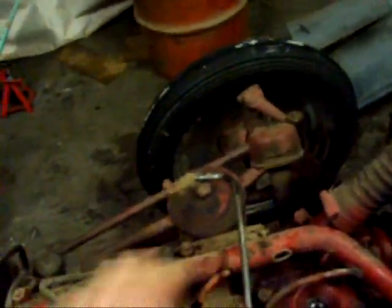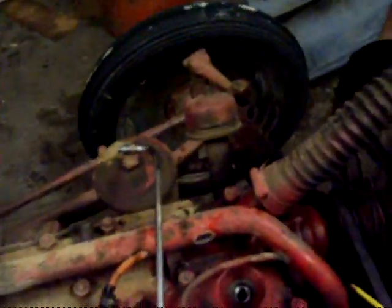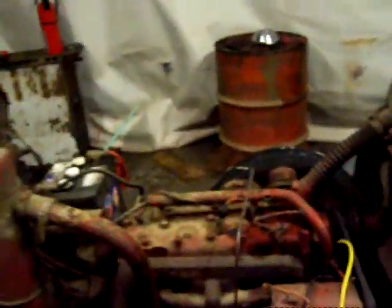And this one we had 10 or 15 psi on, real bad leak coming out the intake. I put my tester on it and blew air through, and you could actually feel it coming out of the other holes wherever the intake valve was open. And you put your finger on the hole, and you'd listen here at the air filter, and you can hear the oil bubbling, the old oil bath air filter. So I'm thinking maybe it needs some valves in there. I'm probably going to pull the head tomorrow and just take a look at them